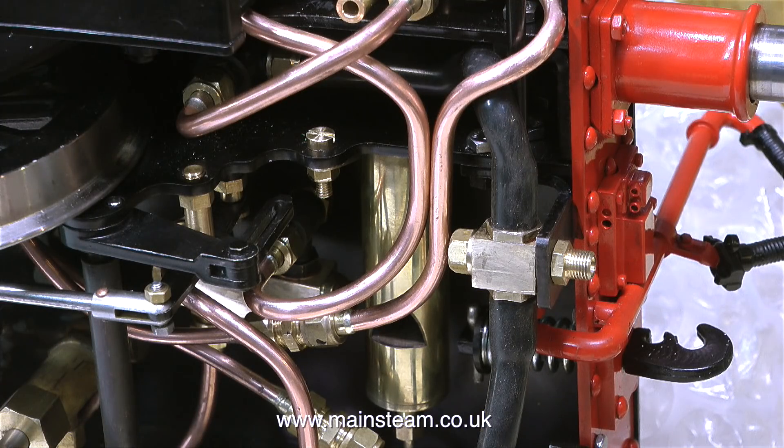You now know how to pipe injectors into a steam locomotive. One viewer asked: why do you need two injectors when you've already got a crosshead pump and a hand pump? A crosshead pump will generally make the engine run slightly erratically, and in order to pump water into the boiler, the engine has to be moving — so what happens if you've got a good fire, no pressure, and the engine won't move? That's a crosshead pump fail. Then it's the hand pump — okay, but they can fail, and if I lose the handle, that's not going to work. So I fit one injector, then a second injector in case number one fails. That's what is known as a belt and braces approach.